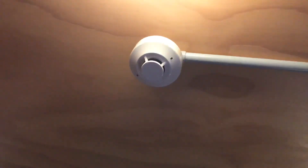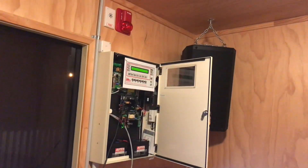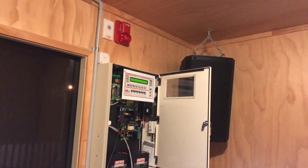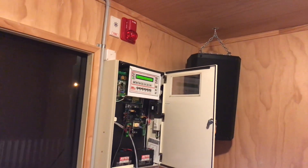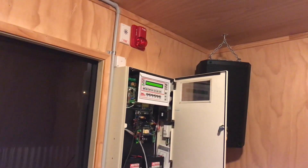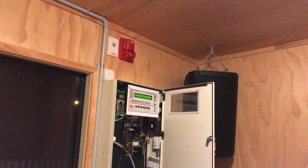You can see I acknowledged the call point alarm and then it went back into the alert stage until that had reset. This is probably the most effective way to stop a false alarm. If someone's home and it has been caused by cooking, they can quickly silence the alarm and it won't send a fire signal through. But if there's no one home or there is a real fire, the alarm won't be silenced and it will automatically send that signal through.